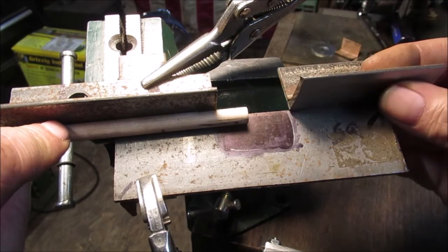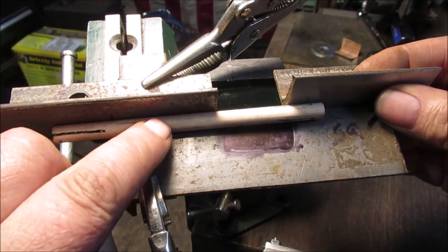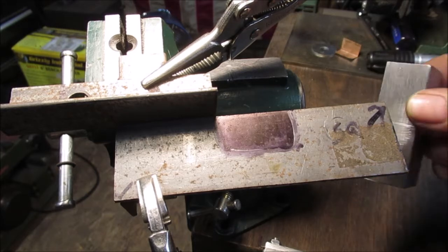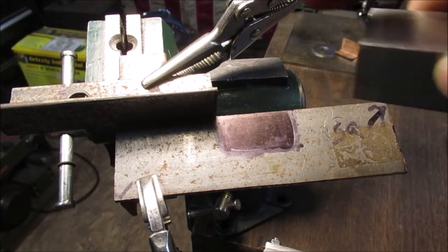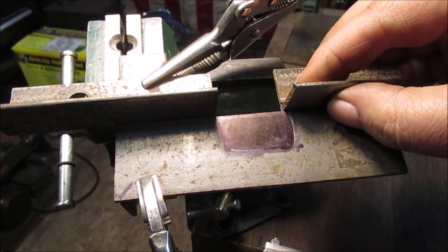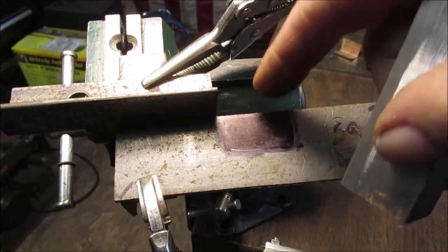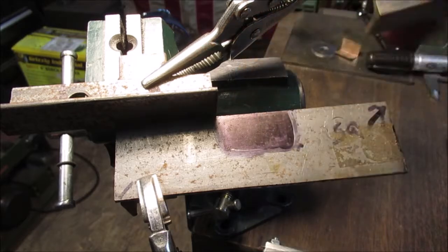Like I said. So you got like that. See, your rod. Say when your rod was finished welding, that's how it would be laying in there. I think you get that. So, like I said, we're going to have the same thing like this. And this just helped weld it together flat. So if that's flat over there, when you put this piece of angle iron, it's going to be flat. I'm trying to make it the easiest way I can because I got so many scraps. And this way it hangs off the vise so there's a hole when I'm outside. That way when you're welding, there's nothing below there.